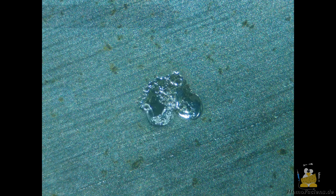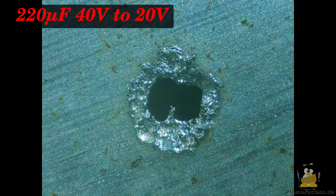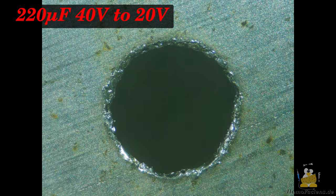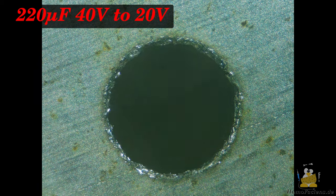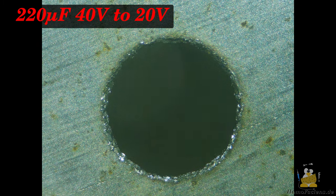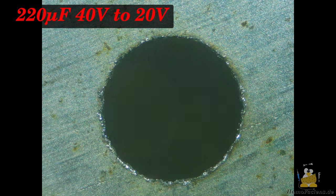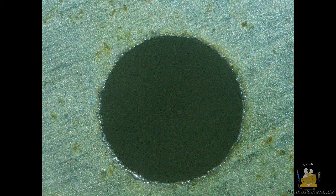Anyone who can write software therefore has a clear advantage. In this experiment, the first 180 shots are made with a voltage of 40V to be able to drill quickly. Then the microcontroller switches to a voltage of only 20V, which makes the edges of the hole much smoother. After a total of 544 shots, this hole is the most precise so far.